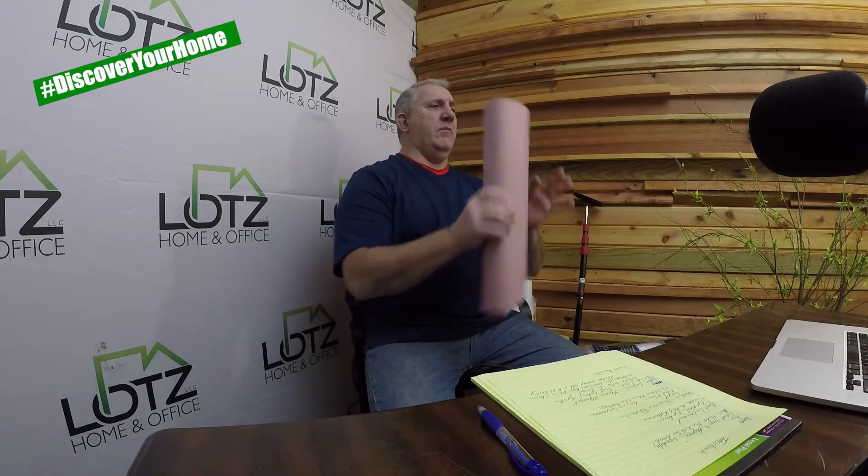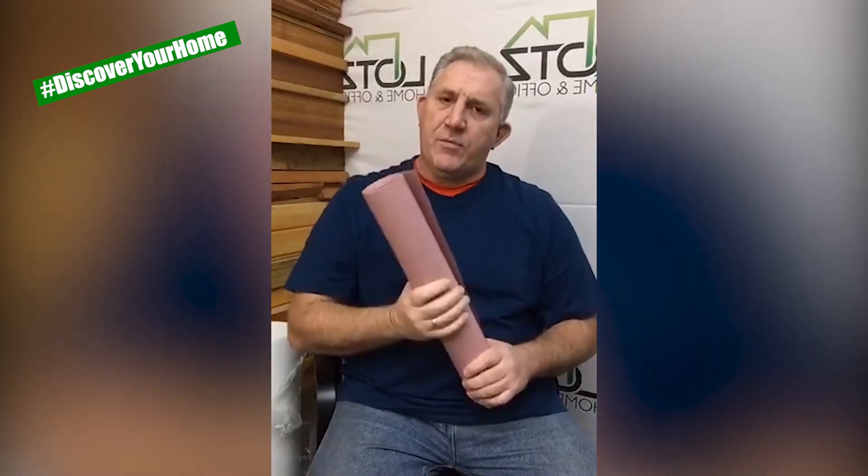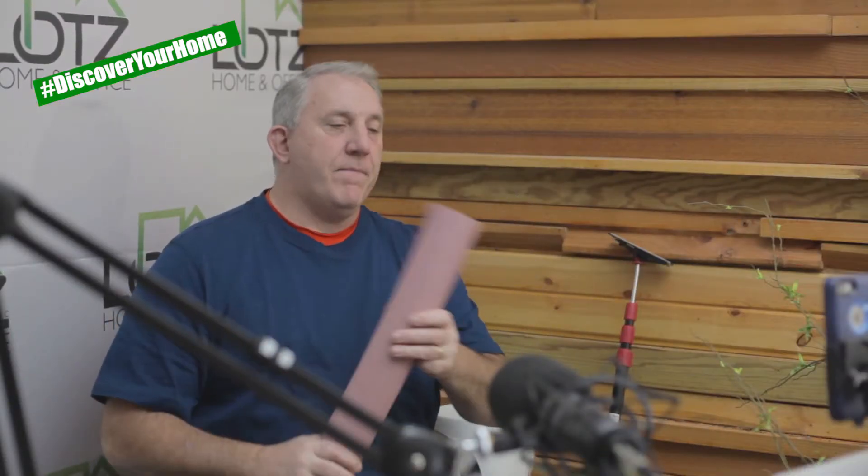Here's another cost-effective product: the old red rosin paper. You can buy it just about anywhere — at the local hardware store. It comes in 36-inch width and we chop it down in half because we like to run the perimeter of a room, say when we're spraying the baseboard, as a nice shield. What I don't love about the product is that in wintertime or springtime with a lot of rain, you'll get easy tears in it so you have to tape it back down. You'll save money on the front end but spend a little more time managing your floor cover system.